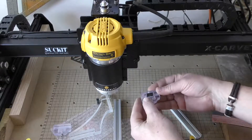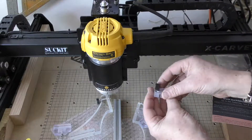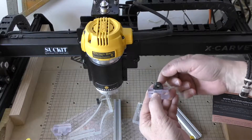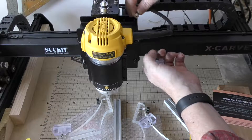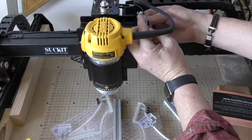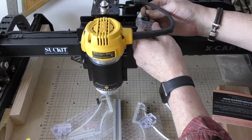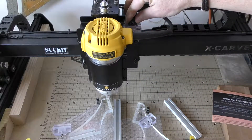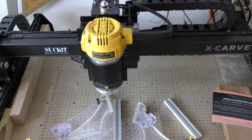What they've done is added a little section up on top — that's now where the Z probe goes. This is going to fit on top just like this. I mounted it so that the deeper well of this little bracket is facing the back of the machine. Then you just undo the little nut and washer off of your Z probe, screw this right in — it's a nice tight fit. You can use the threads of the Z probe and screw it right in, and then this will fit over top and you'll have access to your Z probe.